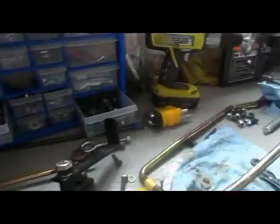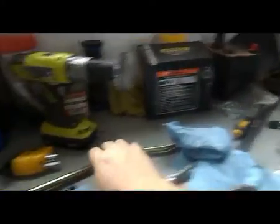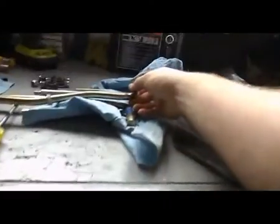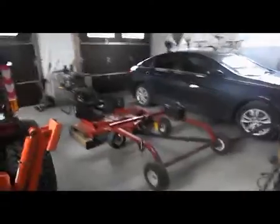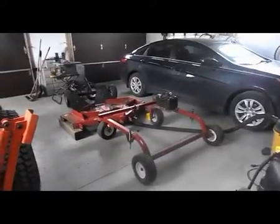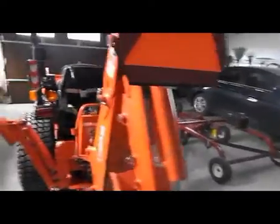If you turn them the other way, it's almost the exact same thing, except at the bottom there's a bit of a curve that, if you turn the other way, goes down. If you put them on top of each other with the curve the way it actually is, you're getting this kind of gap, about a half-inch, which means the deck was truly never square. It was tilted a little bit. So now that I know that, I will flip them around the right way. It's not a big deal, a half-inch over the length of the deck. It probably didn't make a whole lot of difference in the cut, but because I have it all apart, I will put it back the right way.